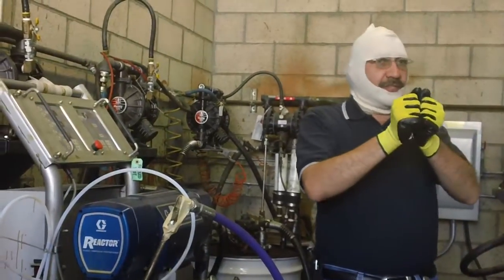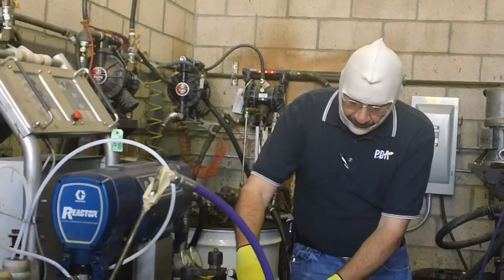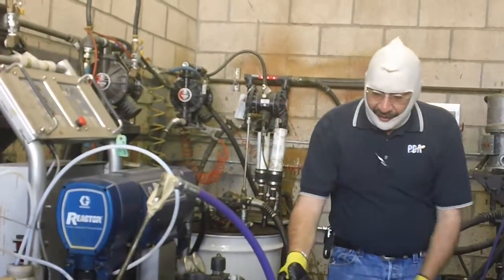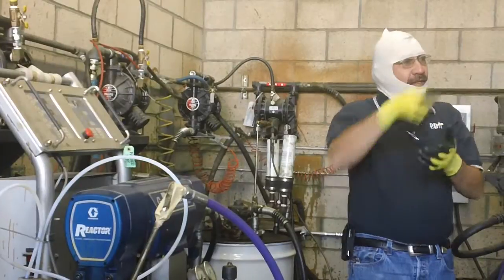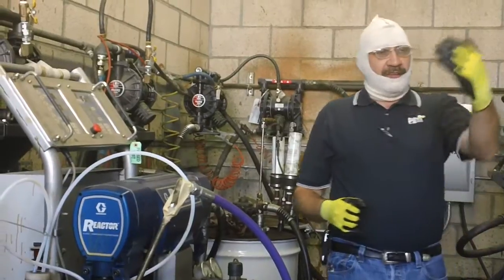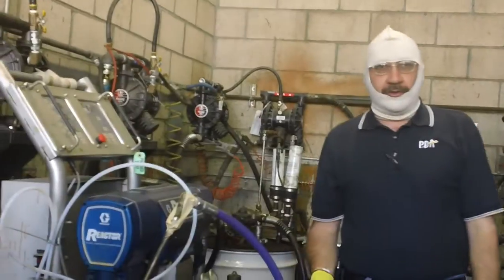Remember, I showed y'all in the class for testing the wheel. With the hoses, we have these undone. We may show you that later. You can take one of these wires out, connect them to the other side so we can loop this around — that way we don't have to drag one end of the hose over to the other end. We can loop it around and do all our testing on one end of the hose. Maybe we have to bring the far end of the hose over to the middle and do all our testing from that way. Just a simple way of minor electrical troubleshooting — voltmeter and ohmmeter.